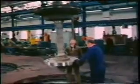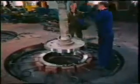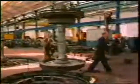Here's another application of thermal expansion on the railways. There are metal tyres on the wheels of many locomotives and other rolling stock which get worn by friction against the rails. Here's a new tyre for a wheel on a big diesel electric locomotive. It's heated by gas jets all around it to make it expand so that it will just fit over the wheel. When the tyre cools, it will contract onto the wheel and stay there, just like the ring gear on that motor car engine flywheel earlier on.